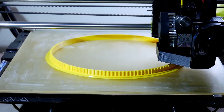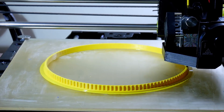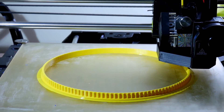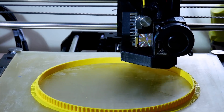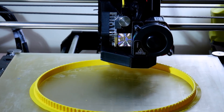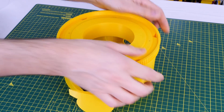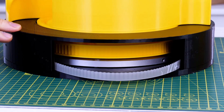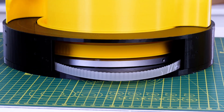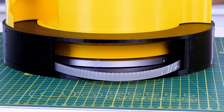Now that works really well we can motorise it and drive it consistently. I'm printing a big T5 pulley and we're going to make this a belt drive because belts are quite forgiving instead of gears grinding together. I've no idea what motor we're going to use yet or how it's going to be fitted to drive through the gap I've left. That's quite a good push fit onto the bottom and eventually that'll just be glued on, and that means we can drive through the gap with a big belt — you can see that T5 pulley turning nicely.